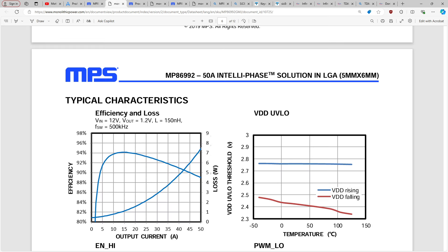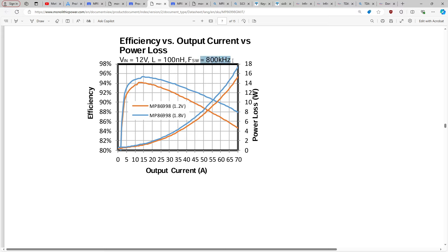This heat output difference could just be down to the lower switching frequency and higher inductance configuration. The funny thing is, if they're including the inductor losses, the higher inductance inductor could potentially be less efficient at high currents. But if the higher inductance inductor is also proportionally bigger, it'll potentially have the same current handling capability and DC resistance — it just takes up more board space.